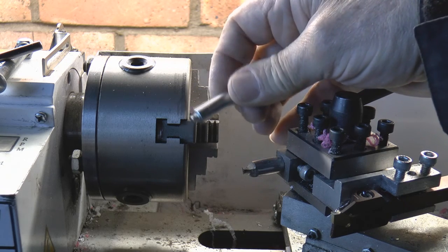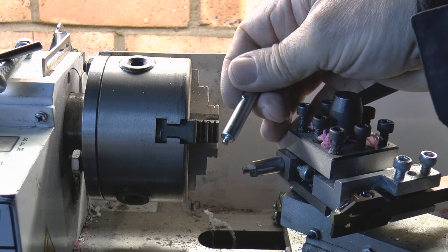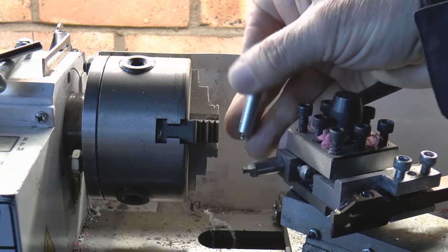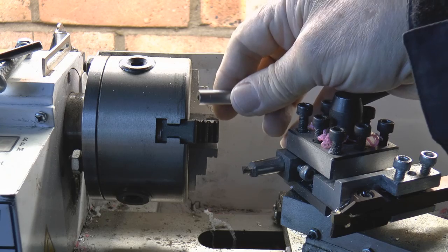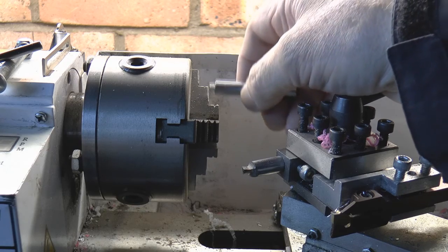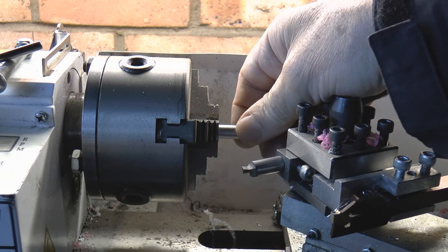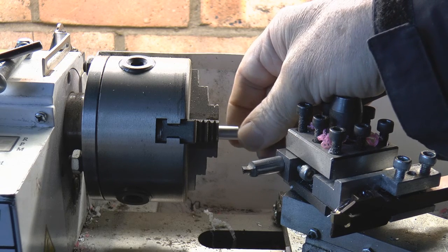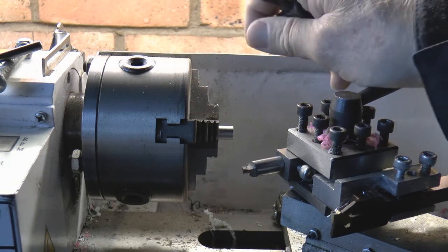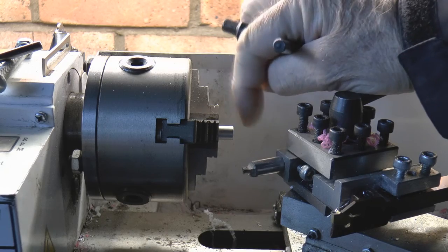Although this is really slim and it fits into the hole in the end of the laser where I'm intending to plug it, it's a little bit small in diameter and far too long to get in there. I'm going to carry out some modifications. I want to make some pieces that will allow me to adjust the collimation so it's perfectly lined up, because at the moment the beam is well out of line with the axis of the body.